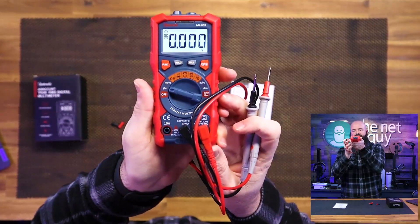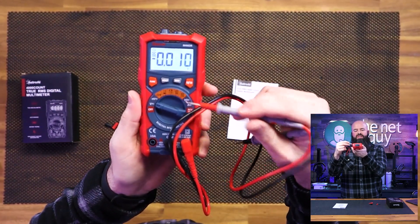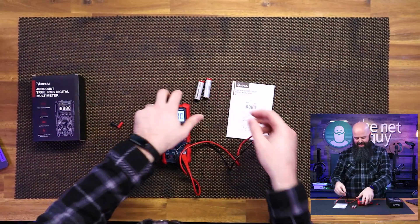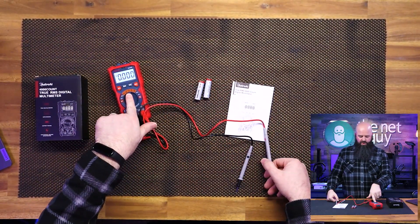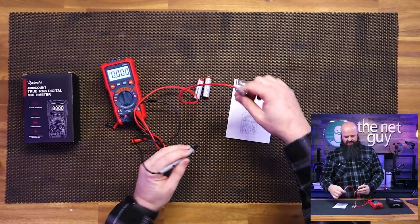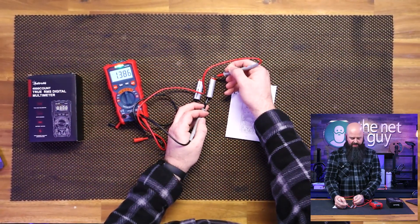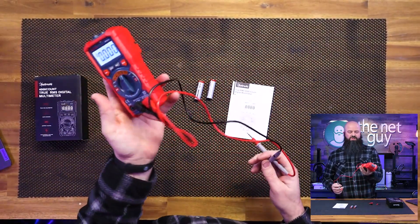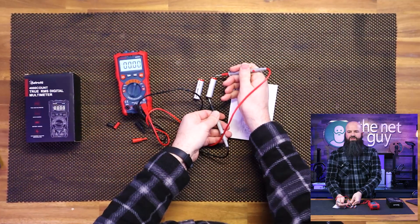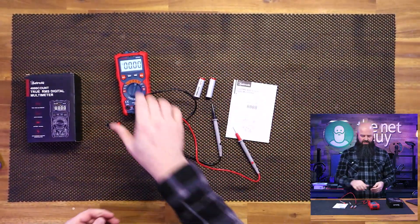One thing that threw me is if you look at this dial — that's where you select it — it doesn't have a direct DC setting. I actually had to go over to one of these specific modes. What's interesting is it's 1.5 volts, nine volts, or 12 volts — your most common voltage tests. I've gotten a couple of batteries out here. As soon as I touch it, there's that green light. It's reading 1.38, which is actually pretty low. You can see how it's got that green versus red light at the top. If I said this was a nine volt battery, you'll see a red light right away, meaning it's way under volts for a nine volt battery. It's actually a convenient feature.